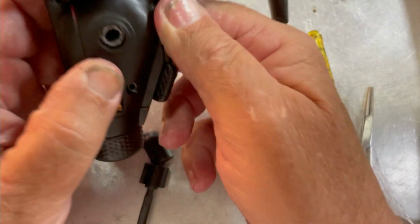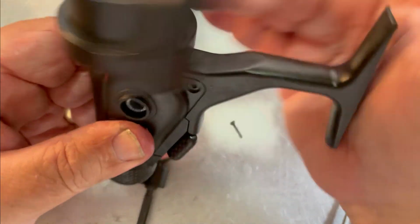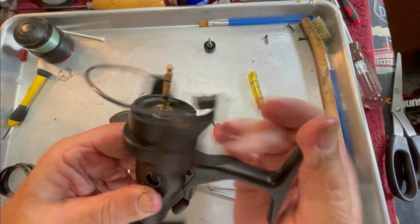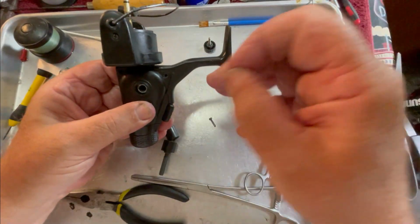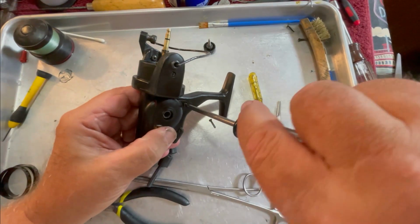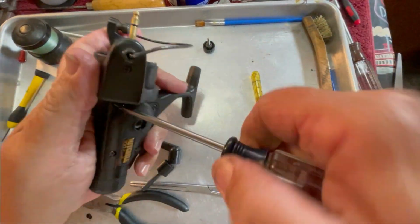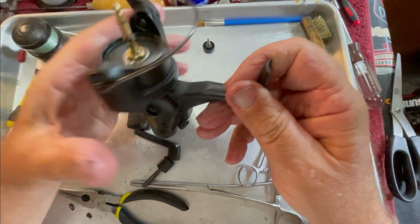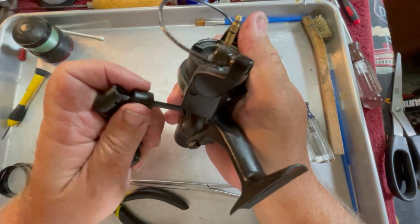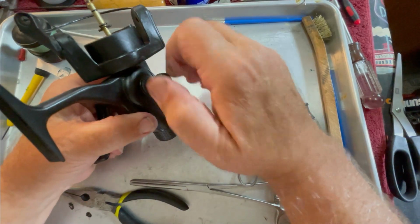Okay, if it's all the way in, you'll have no gaps. Well, first off, let's go ahead and rotate. Make sure that we have our axle shaft going up and down. Which we do. In that case, we're ready to put our 4 side plate screws back in. Okay. Install your handle. Slide it through. Install your handle locking screw.